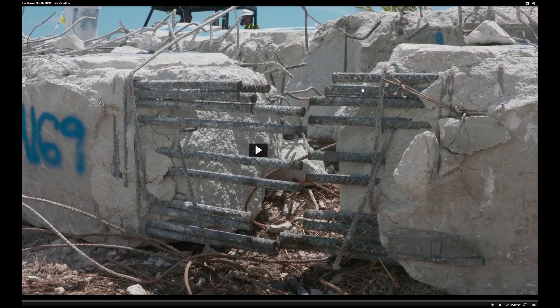I'm also concerned about how unbelievably clean and easily the concrete came off these textured rebar rods — as though you're eating fish and you're just left with the bones. I don't know if any of this corrosion was pre-existing inside the concrete or if it came from afterwards. They're taking these photos on the site, so it's only been sitting there maybe a few weeks. I don't know if that's enough to make it corrode to this point.